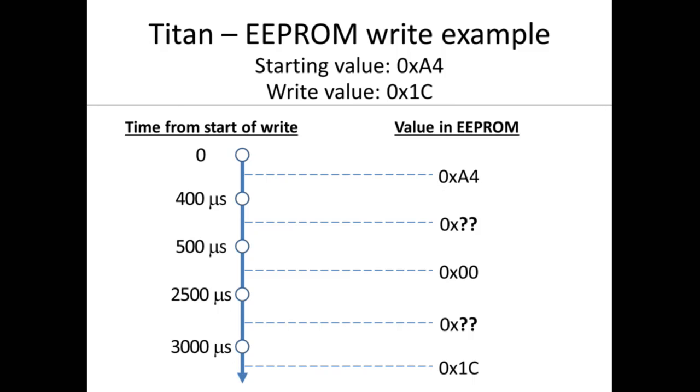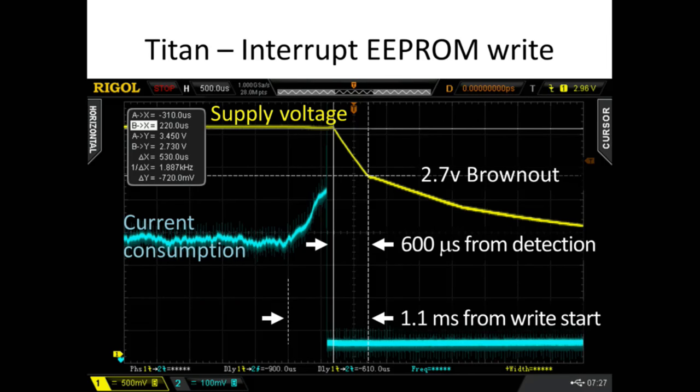All right, so turns out, even better, we know exactly when to do that. That second current rise that we used for the timing attack ends up being actually the start of the write for the incorrect attempt count. So if we key on that, we can accomplish our goal. First of all, we're able to get the voltage low enough quickly enough. If we start at a somewhat lowered voltage but still valid, we can actually get below the brownout voltage for the microcontroller in about 600 microseconds. So we know we can get there once we start.